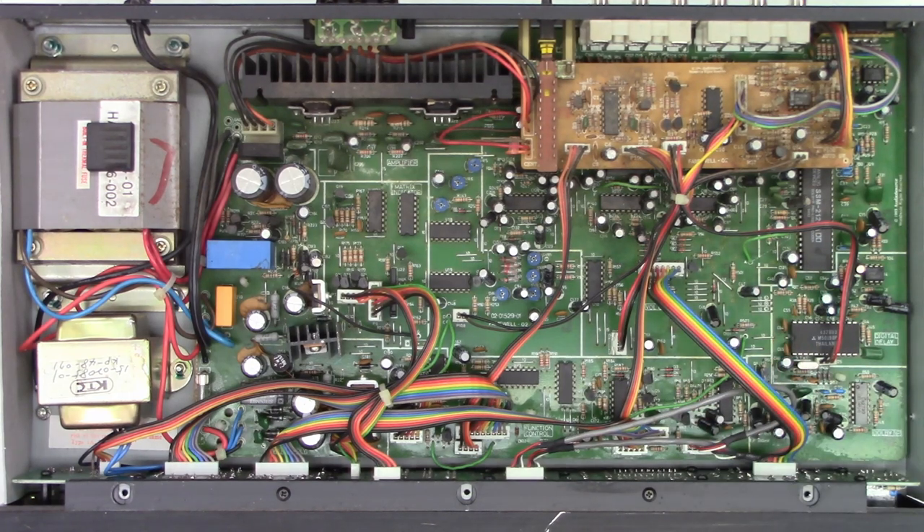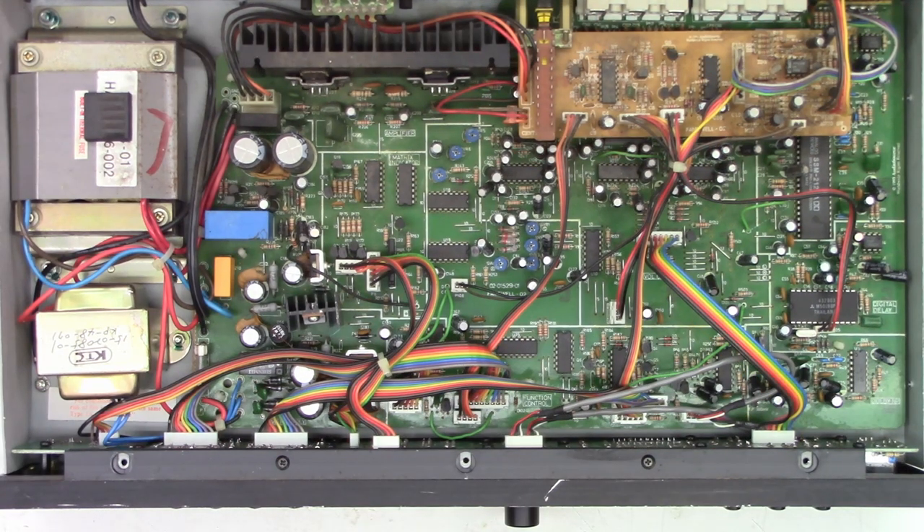Let's go ahead and hook this up. I'll put the signal generator into it and we'll see if we have equal levels coming out. I've got the unit connected with a 1000 Hertz audio signal going into the left and right audio, and the front output connected to my stereo receiver. Let's turn up the volume. Oh, listen to that static — that's bad right off the bat. I'm only getting the test tone from the left channel, and listen to how scratchy that is.